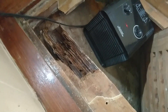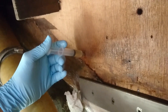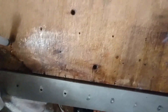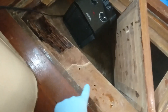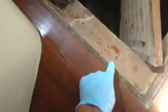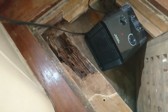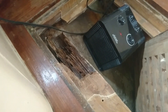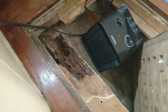When it's warm it will soak epoxy way better. I don't want to thin this epoxy too much — I did thin it on the other beam but I had smaller holes. Now I have some big holes, I can just pour it over here. I drilled quarter-inch holes just to make sure I can penetrate the whole beam. Now I'm mixing epoxy, then I switch off the heater and apply the epoxy.